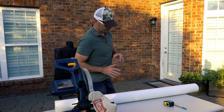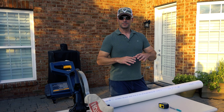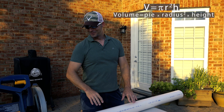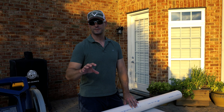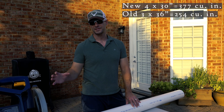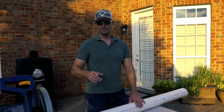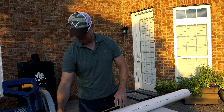One of our design improvements is we're going to switch to a four-inch air cylinder instead of a three-inch. The last one was three inches by 36 inches; this time we're going to go four inches by 30 inches. Doing some quick math and formulas that we found online — I'll post them here — we've calculated that this cylinder, although shorter, is going to hold almost 50 percent more air than our last one. At the same air pressure, that should give us more air behind our bait going out the barrel, which translates into more velocity and a longer distance. We're going to go ahead and measure this up to 30 inches.